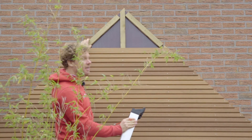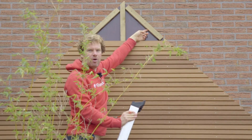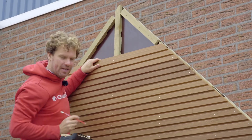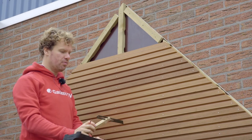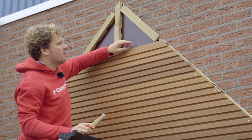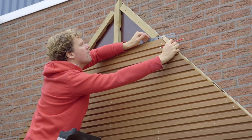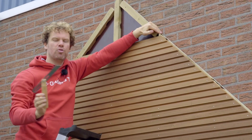We've arrived at the tip. This needs some extra battens, otherwise there's nothing for the nails to hold onto. You can see the same ventilation arches as before, perfect for vertical ventilation. Here at the very tip, our layout lets us hold a board in front of the surface area and mark out the edges. You may not have the same luxury, so here's what you need: a T-bevel square. It's a handy tool for calculating the exact angles of your corners. The handle goes along the outside and the blade along the board. Tighten the nut, and that gives us the exact angle at which to saw the board.